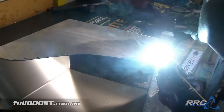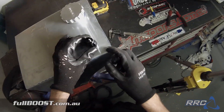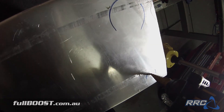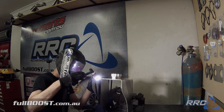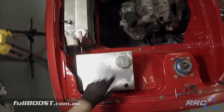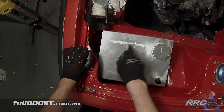Now that the box will hold its shape, it's time to weld the base, the filler neck and return fitting in place. Next step is to weld, and to do that we obviously need to drill some holes first. So we can see it taking shape — that's our fill, this is a breather and also a rollover vent, so it's dual purpose. Next will be to mill out this section for our three pump setup.